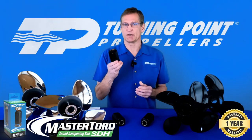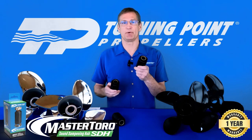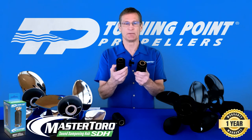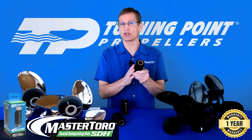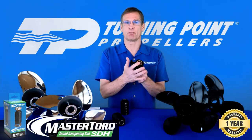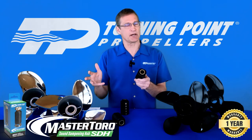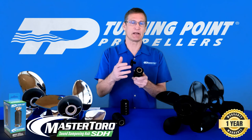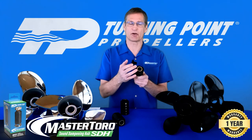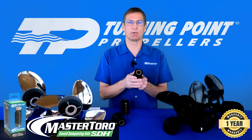The beauty of this hub system is it has many of the same benefits of our traditional hub system — you'll see they almost look identical. It has one-piece construction, which is very durable. It has a naval brass spindle that won't corrode in a saltwater environment. Some competitive brands actually use aluminum, and they either anodize it or paint it. If it gets scraped and corrosion starts, it can actually adhere to the shaft, causing an expensive repair.